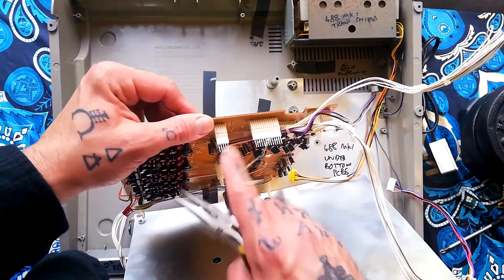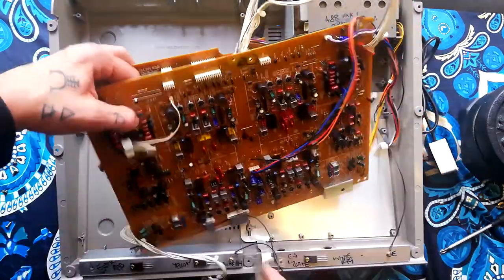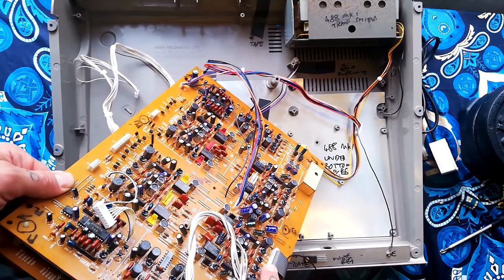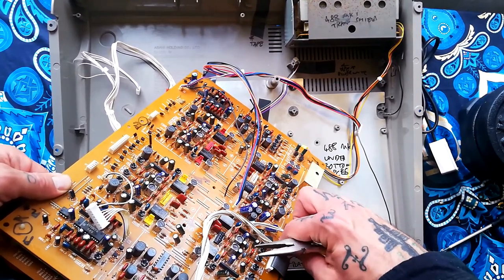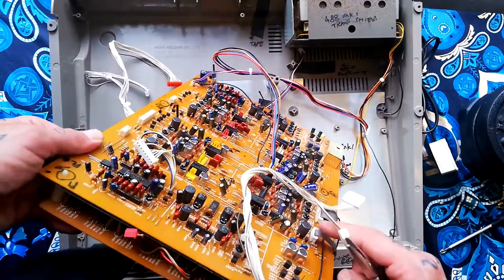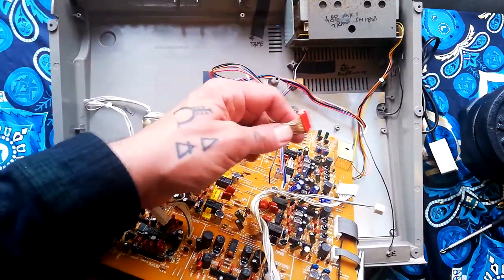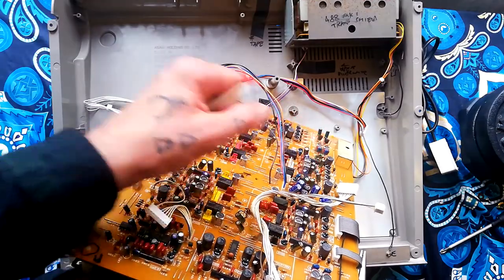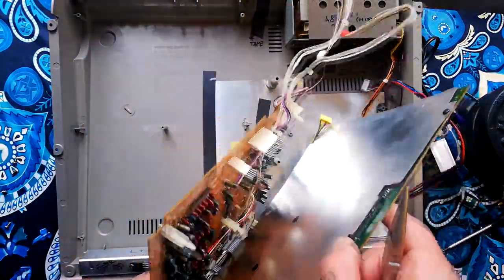You can see how these pins pass through the board into reverse sockets — basically the pins come in from underneath. The other electrical connections are these ribbon cables. I would advise that you don't remove them. You'd use a flathead screwdriver to make the little spring things inside release their grip, but I always find it's really difficult to get the wires back in. I tend not to open these, and if I do I usually replace them with JST plugs, which can be easily removed and reinserted hundreds of times without worrying about the connection.